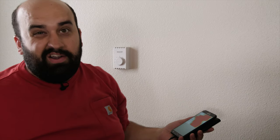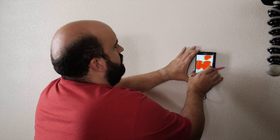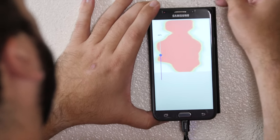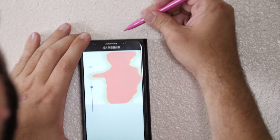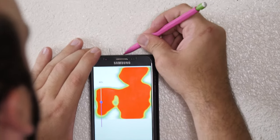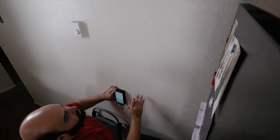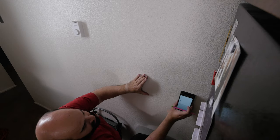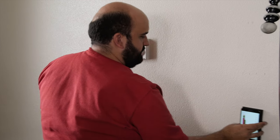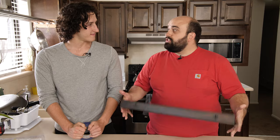I'm going to start to mark off this area. I know this is about where I want to put my shelf. It looks like my stud starts here and probably ends about here. And then that electric wire or pipe is running right along here. So basically I want to avoid this whole area — I don't want to drill in here. I could either hang one side of my shelf over here where there's nothing and know that I'm not going to hit anything. There's that stud. It's crazy how fast it is. All right, we've marked out our wall with the Wallabot. We know where the danger spots are going to be.